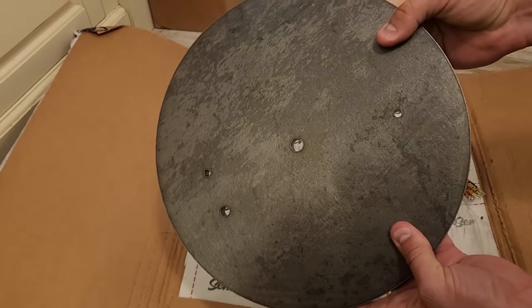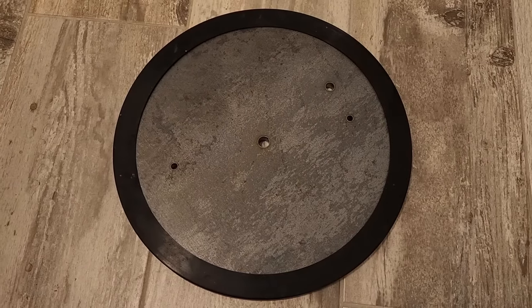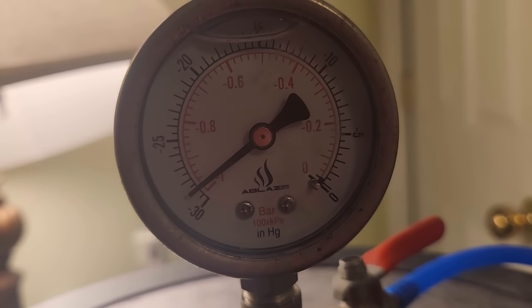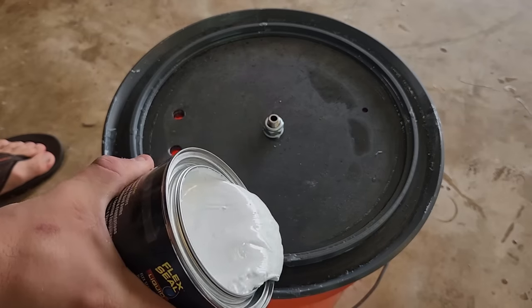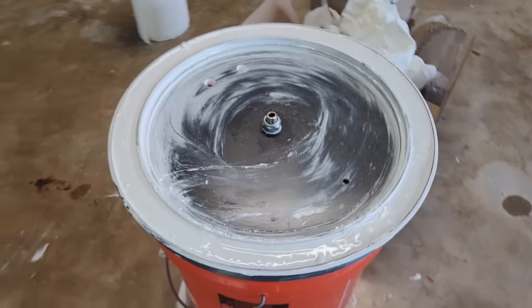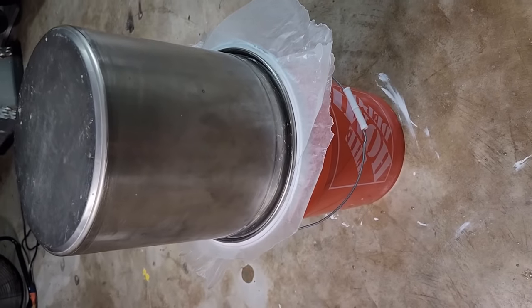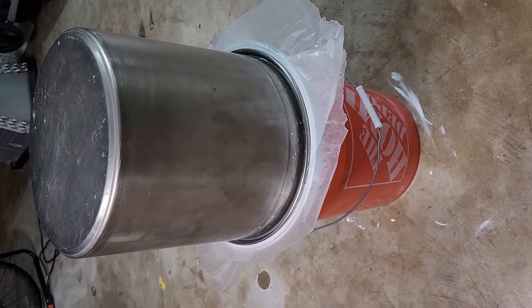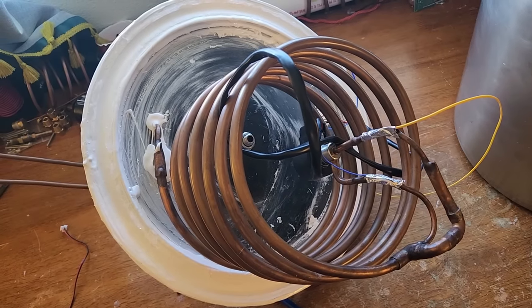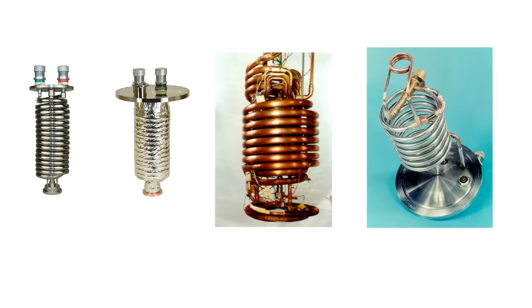The vacuum lid was a half-inch thick steel disc fabricated by SendCutSend, which was actually cheaper than buying and drilling the raw material myself. It's the exact same dimensions as the tempered glass lid that my vacuum pot originally came with, so I can reuse the same gasket. Unfortunately that gasket would leak on the steel plate, so I had to 3D print some edge rings as molds and fill them with Flex Seal to form a thicker gasket. When the rubber was partially cured but still soft, I placed the vacuum pot on top so that the lip of the pot formed an impression in the rubber, making the gasket conform better when fully cured. Here's what the lid looked like once the rubber was dried and the heat exchanger installed — a little messy, but it looks surprisingly similar to a commercial system.